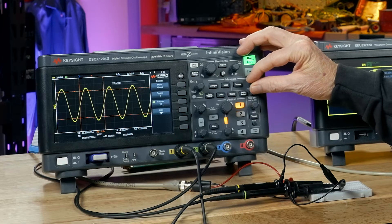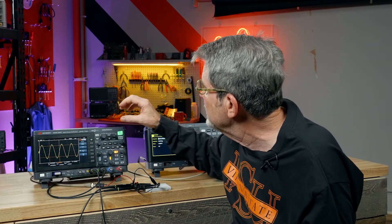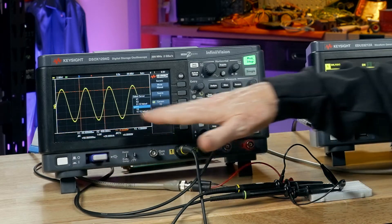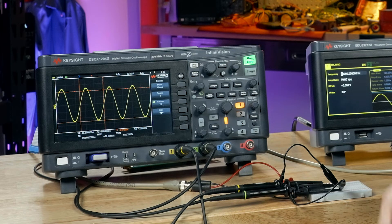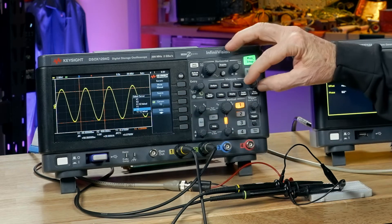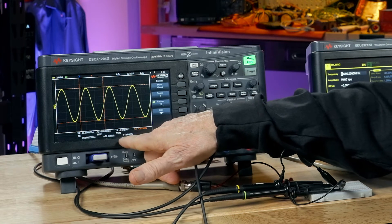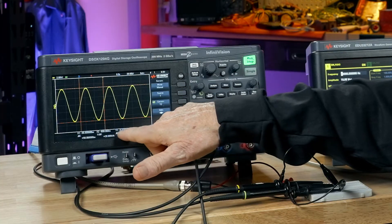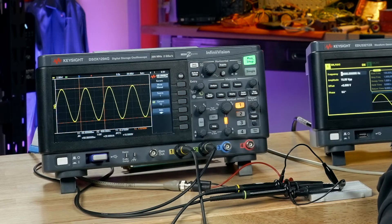If I position this one a little bit differently, now it says exactly 20 kilohertz. Now let's measure the peak-to-peak voltage of this signal. I'm going to change this button from x2 to y1 — the lower vertical cursor — rotate the knob, and position it at the bottom of the waveform. Then change to y2 and rotate to the top. Now it says delta y 10 volts — exactly what we're putting in. This is V-in. We can see y1 is at minus 5.07 volts and y2 is at plus 4.92 volts, measuring the positive and negative peaks.